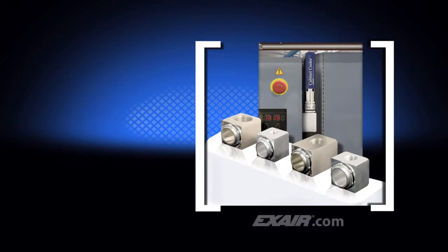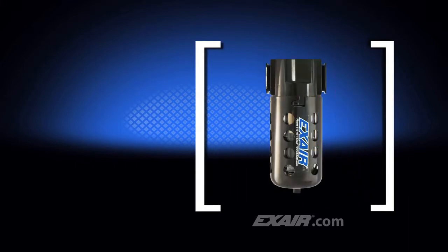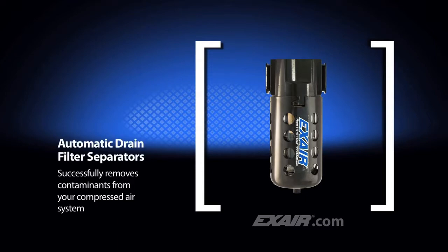Some people worry that the cabinet cooler might allow water or dust from their compressed air line to make it into the enclosure. Now that's not going to happen. When you mount the EXAIR cabinet cooler system to your sealed enclosure, the automatic drain filter separator will trap any dirt or moisture to keep the inside of the enclosure clean and dry.